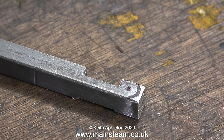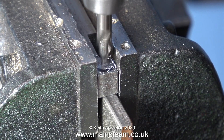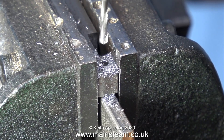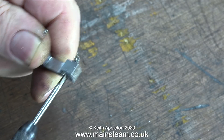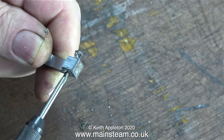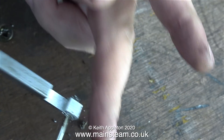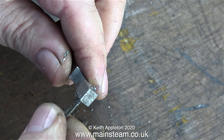This part has to be drilled in two places and the end shaped. So it's over to the drilling machine — I'm using a centre drill as always to start the hole off in the middle, followed by a tapping size drill for 5BA which is 2.7mm. But I haven't got one of those, so I'm using a 2.6mm diameter drill, which is fine. As always I started the tapping process while the part was still in the machine vise, then I removed it and completed the rest by hand, because this is quite a small tap and if I did it in the milling machine I wouldn't be able to feel when it was binding until it broke off in the work — and I really don't want that to happen.